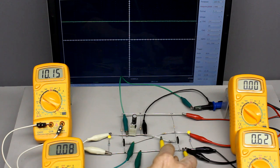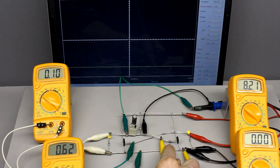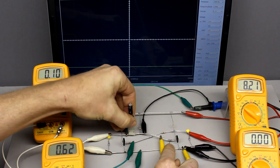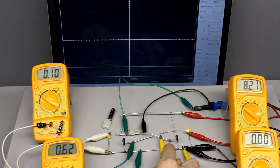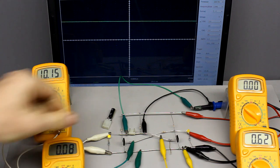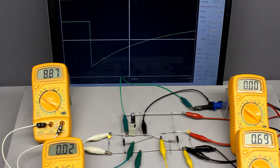Without the capacitor connected, a voltage of minus 0.1V can be detected, and the processes run with nearly no delay. The charging procedure, limited by the current running through R2, affects the turn-on time of the left transistor. When reinserting the capacitor after the button was released, we can see the left LED going out for a short span of time.